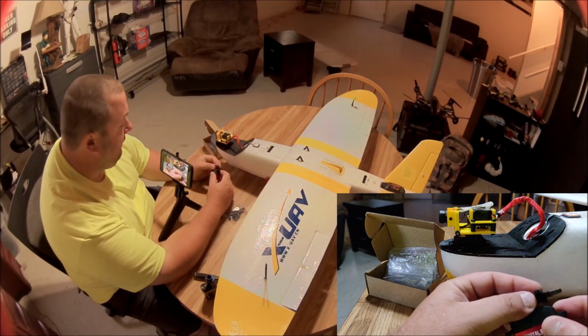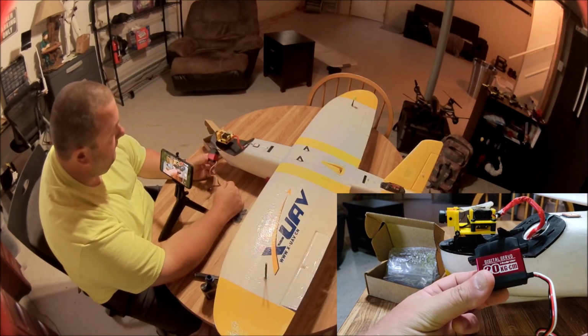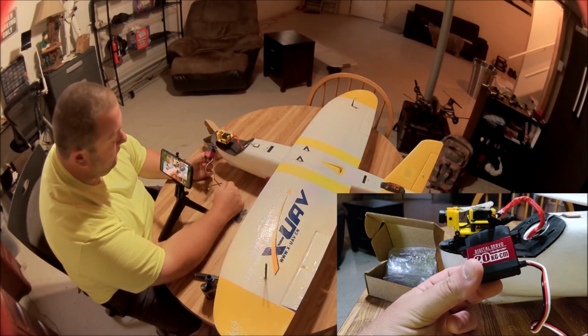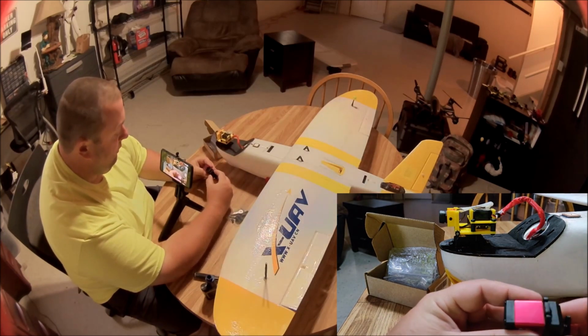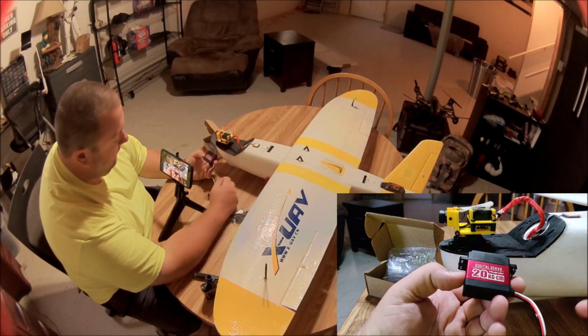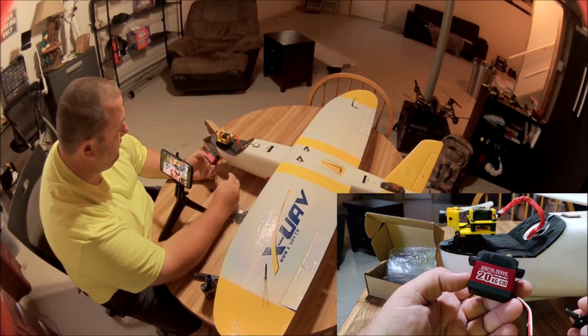So I have a link in the description for this servo, but don't forget that you need to change the PWM width to 500 to 2,500 to get the full range. Don't come back here and comment, I bought the servo you linked and it doesn't work, because I'm telling you, 500 to 2,500 will give you the full range.